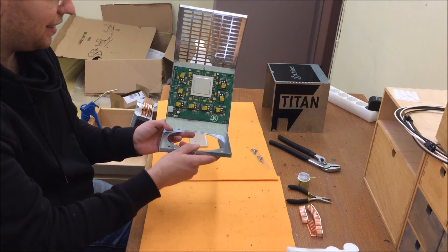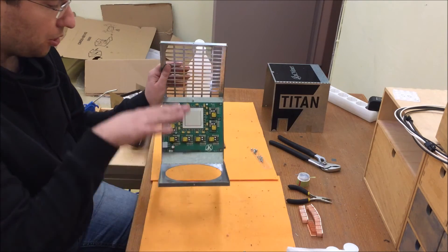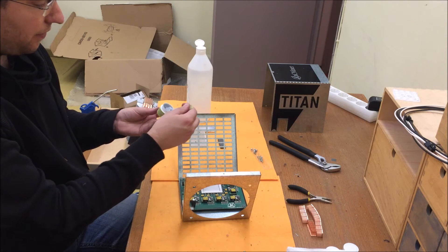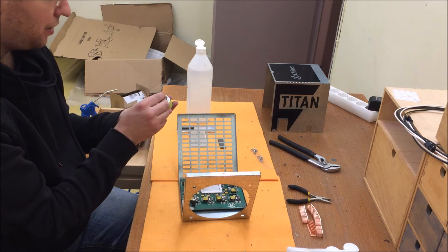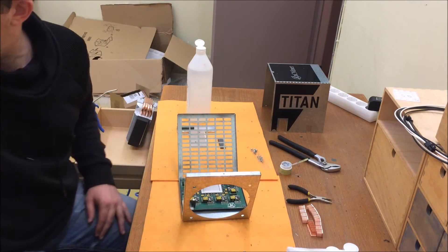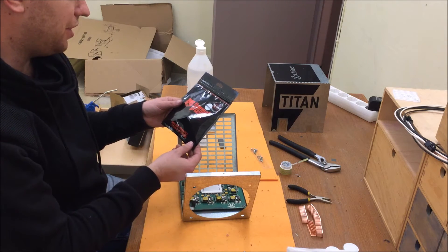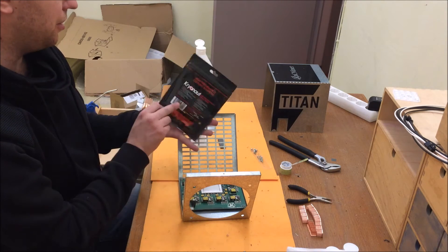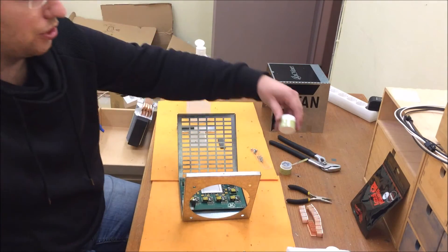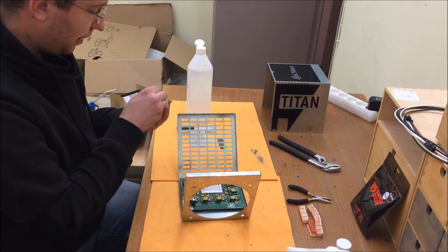This is how it looks when it's totally cleaned out. What we'll do now is put new thermal paste, put separate heat sinks on these four DC-DC converters, put a new fan, and then mount it all back together. Let's start with the thermal paste. I'm using GC Extreme. I looked on the web and compared different brands and this one showed up to be the best. This one is actually almost empty so I'll finish this one and start the next.